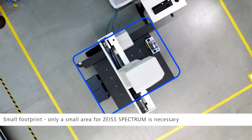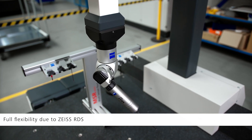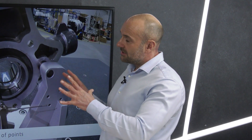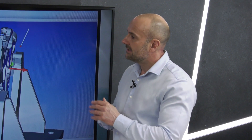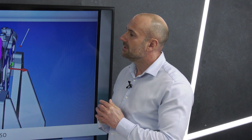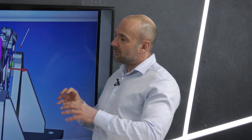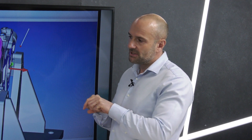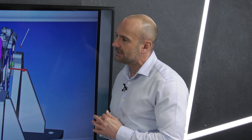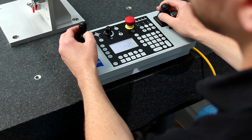The Spectrum also features glass ceramic scales, which are unique for a CMM in this class and not available in any other CMM in the marketplace. Glass ceramic scales have virtually zero coefficient of thermal expansion, so there's no need for thermal correction sensors to be built into the system. Zeiss also uses a proprietary method of fixing these glass ceramic scales to the system, which is only recognized and used within the Zeiss technology arena.